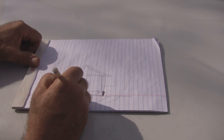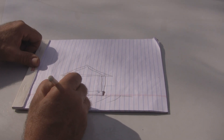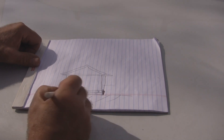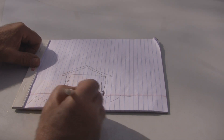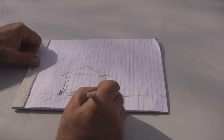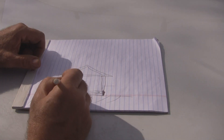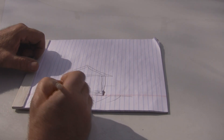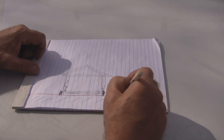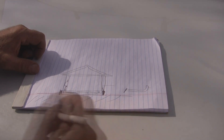If there's a panel here in the wall, before those walls are built they'll have the plans and they'll know they need a piece of conduit coming up and going underneath the concrete. What they're doing is stubbing up — putting a stub into where the wall is going to be, and over here where there's going to be an outlet, they stub up into there and that stub sticks up about three inches. After the walls are built they come in, put the can in the wall, and run conduit from there to the box. When they stub up into the wall they're making a 90-degree elbow, and that's where the term stub up comes from — that's why they call a 90-degree a stub.